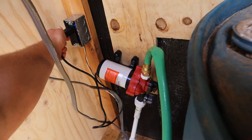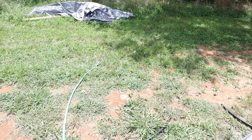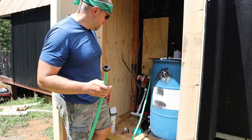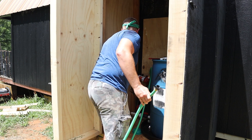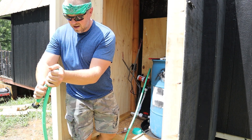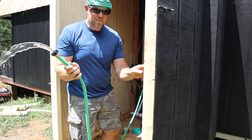I'm going to unplug this real quick. Now, in order to test whether it is controlled by flow, let me put a valve on the end of this hose and turn it off. I couldn't find a valve to put on here, but I think if I kink the hose, we should be able to turn off the diaphragm pump because it'll think no flow is required. There's our flow. It still has a little leak to it, but yes, it thinks it's off. And now it's back on — very cool.